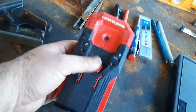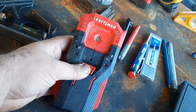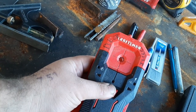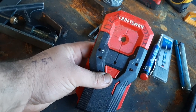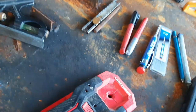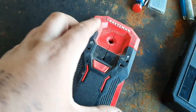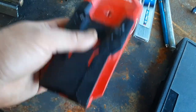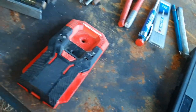Stud finder — really not as much of a measuring instrument as it is just a working instrument. But sometimes you're installing handrails in a residential house or in a commercial building that is indoors and you have to make sure your mount points are into studs, because you are not going to mount handrails into the drywall. Somebody's going to put their hand on it and whammo — your handrails are ripping the drywall out. Simple contraption: you push the button and you slide it until it goes beep. That tells you there's a 2x4 or a stud behind the wall. This one will detect metal and wood studs, so you need that one for commercial buildings with metal studs.